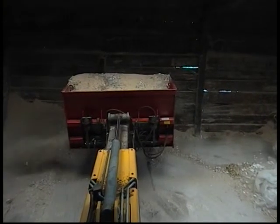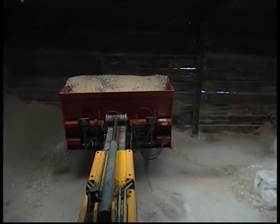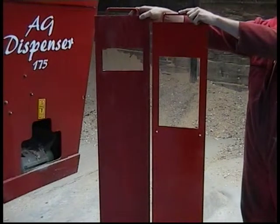If a machine runs in one direction for a short period then stops, then in the other direction for a short period then stops, the holes in the slides need enlarging towards each other. As shown, holes can be adjusted from 200mm by 100mm to 200mm by 300mm. Ensure holes are enlarged equally.